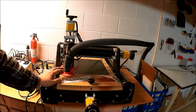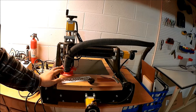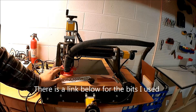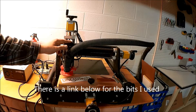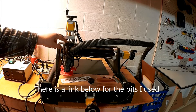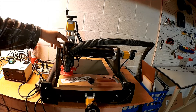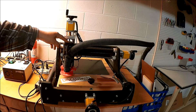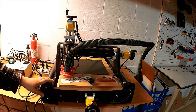I went to eBay and I'm going to be using a 1/8-inch 2-flute milling bit — a blunt end mill in the Porter Cable that's supposed to be designed for plastic. Ideally for this you'd want a 1-flute rather than even a 2-flute, but I could get the 2-flute a lot cheaper. I got a package of 10 for $13, so under a dollar a piece for the bits.